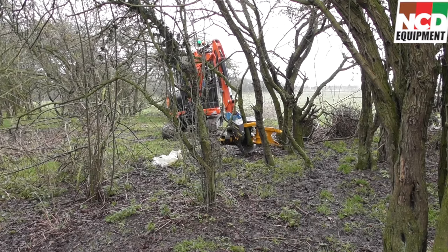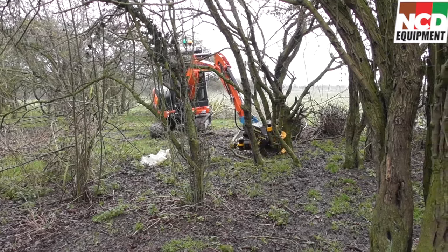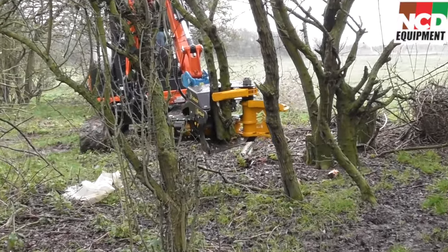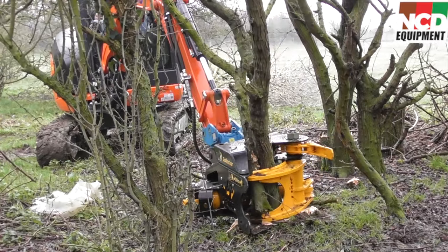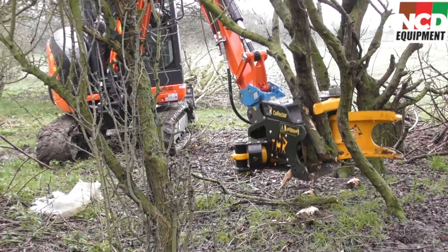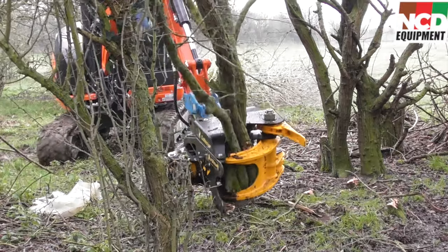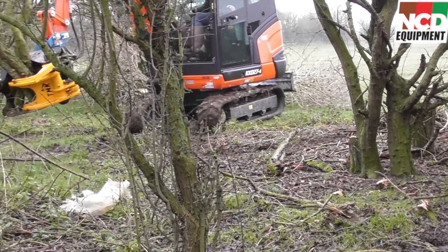This is giving it the speed to work really efficiently, but also when it does come across anything a bit more chunky it's got the power to cut through it as demonstrated. The TNK collector is not only good on really small stuff to accumulate little bits and pieces, it's also good on stuff up to about two, three, four inches. As you can see here in this close-up clip, the turbo cylinder is working really well in the background for the slightly bigger timber. We were able to cut about four trees in quite a tight little area where I couldn't really slew around because of the other vegetation, so this allowed me to cut four trees, pull out, drive out, drop them off, then come back and collect the others — making it about three times as fast as without the collector.